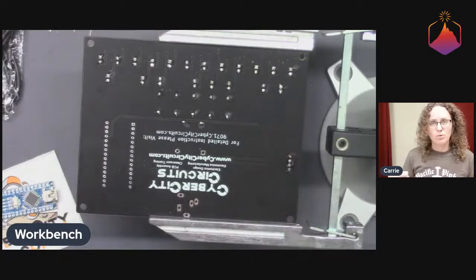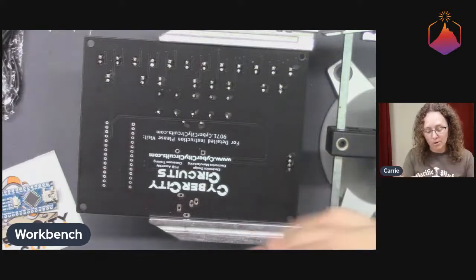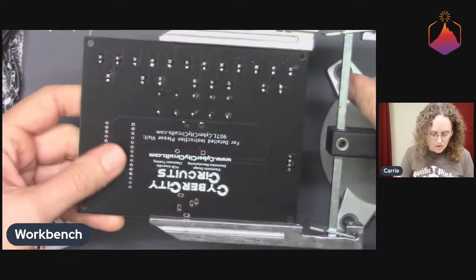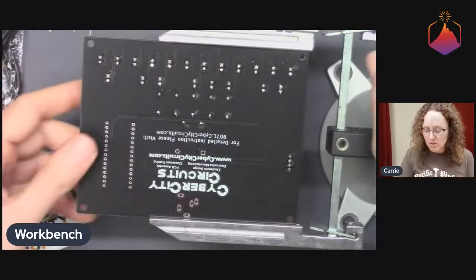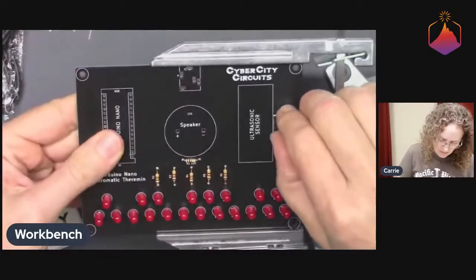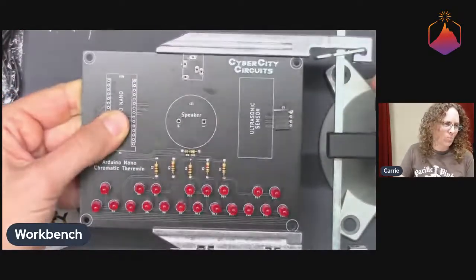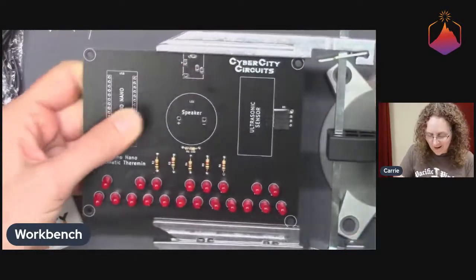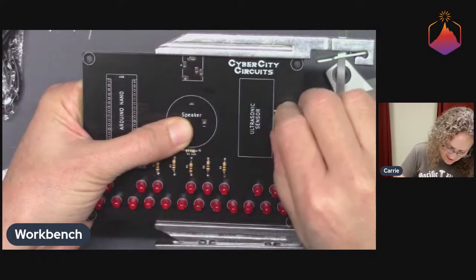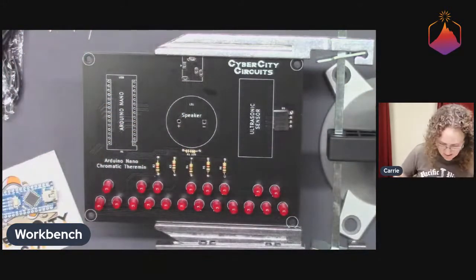Generally when you pre-apply solder to the iron, the flux tends to burn off before it gets to the board. And the flux is what makes solder flow, keeps the joint clean, and makes the metal bond to each other nicely. All right, well, that's a little bit skewed, but not too bad. That's a little crooked. Good thing I'm not a perfectionist. I'm a get it doneist. I could very gently wiggle it around here too. Whatever, it's fine.